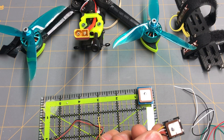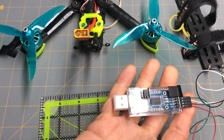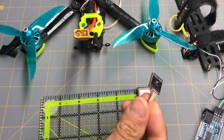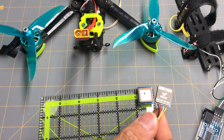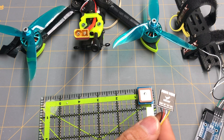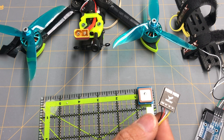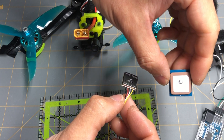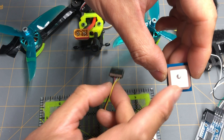With the HGLRC M100 Mini, I was able to connect it with UCcenter and play around with the ublox settings. I think all the settings are good to go — the only thing I changed was that it was running on balanced power. I switched the power management setting to full power. Previously I had the BN880 and BN220 also on balanced, and I switched those to full power as well and didn't really notice a huge difference in battery drain.